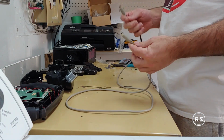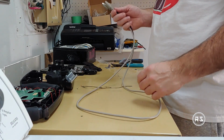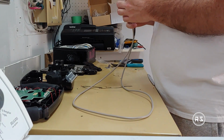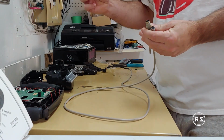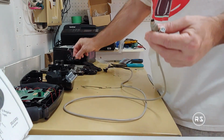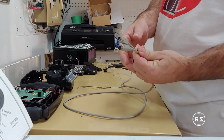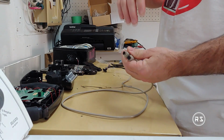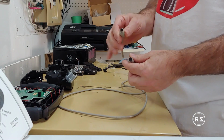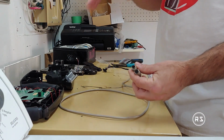I don't know if I mentioned before, but to connect the wheel to the wheelbase, which will be almost 3 feet from one to the other, I bought a PS2 mini-DIN cable so I can connect them. As you can see, this is the connector of the wheel and this is the end of the cable. It's a male to female cable. The thing is, I don't know those cables and I'm not sure if they are crossover or whatever, but when I connected it to test on the PS4 on the wheel, there was all kinds of things. I don't know what button was being pushed, but as soon as I was connecting the cable to both the wheel and the wheelbase, the screen was going crazy, so something was wrong.